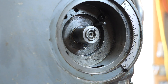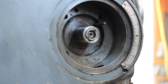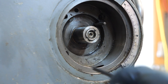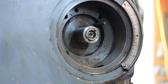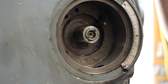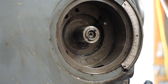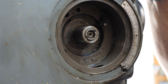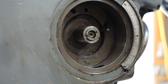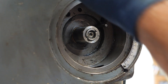You can see the socket head screws on the outside of that flange. I tried to put a set screw in there and it went right inside the chamber, so now I have to open the back. What's cool about this is this kind of yoke that the thing rides in — the fit is just fantastic. You can feel just how precisely seated it is in there, and even when it's all loose it's still binding a little, which indicates just how precise a fit that is.